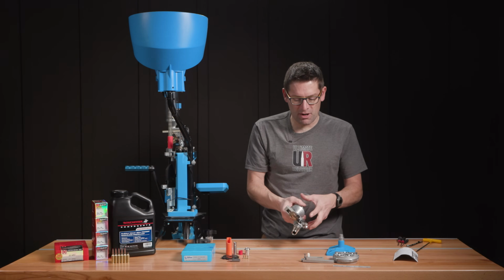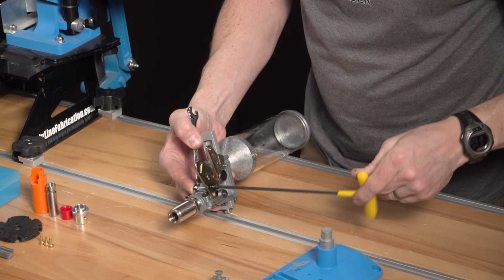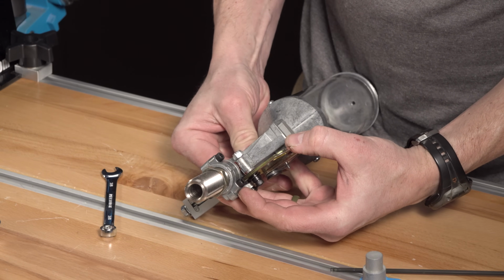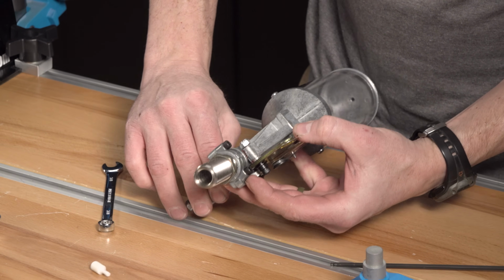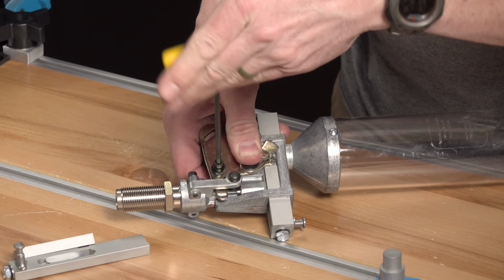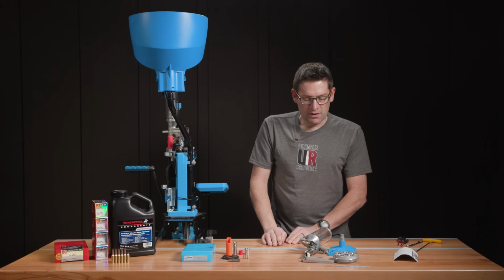It's basically just a matter of putting an Allen key in one side and then using a closed end wrench. You loosen things a little bit so that you can pry these plates away, and there's a little nylon block there. Slide it out, slide the new one in, and then tighten things down, and then just make sure that things smoothly actuate. So that's no big deal.